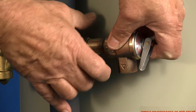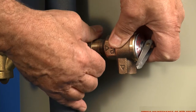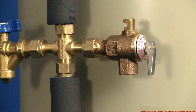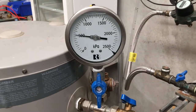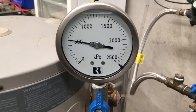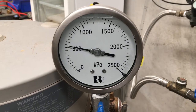During the heat-up cycle of a storage hot water heater, the water within the cylinder will expand approximately 3% no matter when the expansion commences. We have prepared a short video to show you in real time just how quick the pressure within the storage water heater rises. We've set up a water heater here with 500 kPa inlet pressure and just turned on the electric element. You can see just how quick the energy going into the water heater starts to expand the water.